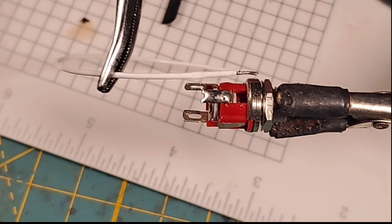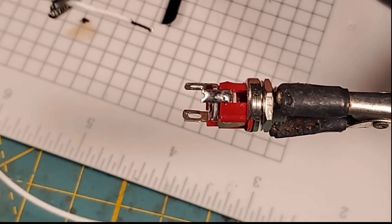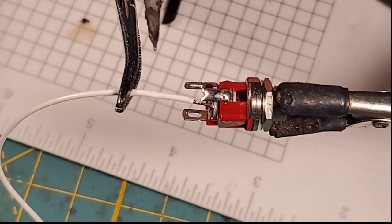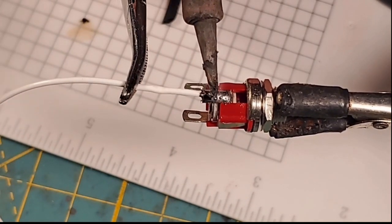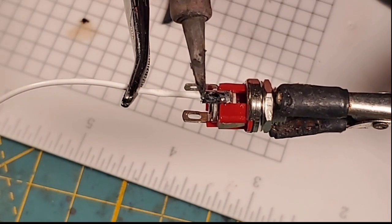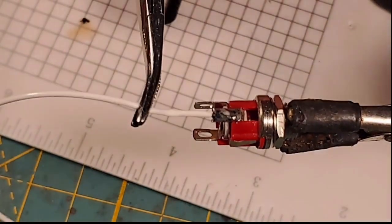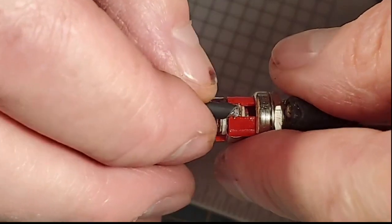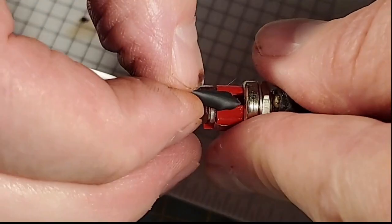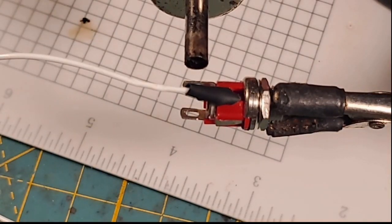So this wire isn't that long. Y'all can't see the whole wire on there, but I'm going to put this down. You can also see my piece of shrink down there that I'm fixing to put on this. So this wire is loose. I've already pre-tinned it. That wire is loose because the next place this wire connects to will be our Proffie board. So I'm going to put our piece of shrink on there, and if you saw that, I cut it on an angle so it helps cover up the pad here, and we're going to shrink-a-roo this sucker up.